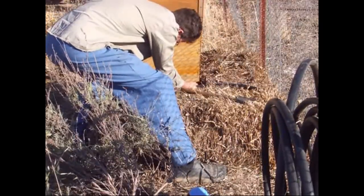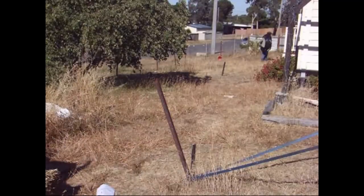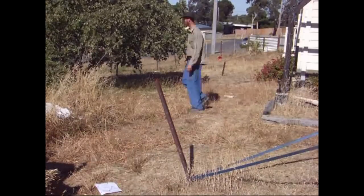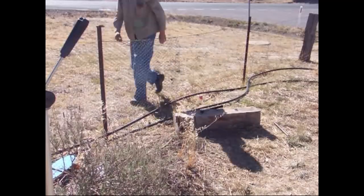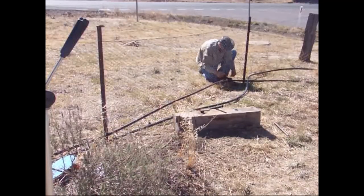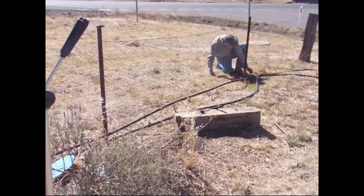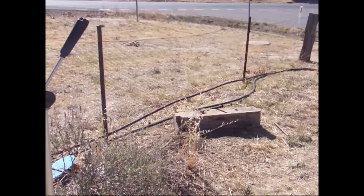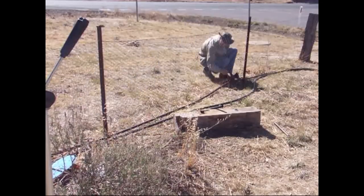Time to connect the hose, connect the pipe and then roll it out. The next stage is loading out the hose — this bit is annoying. You've got to have a consistent fall going down, you've got to have a consistent rise coming up. Get it wrong and the thermosyphon doesn't work. Even a small airlock can mean that it just won't work, and this is particularly the case when the fall and the rise are relatively shallow.